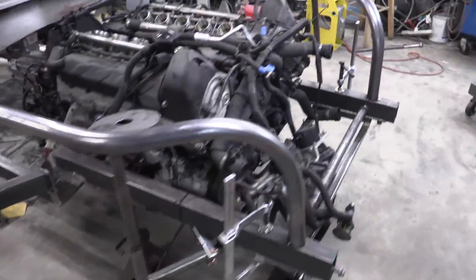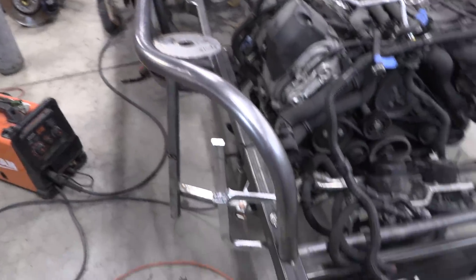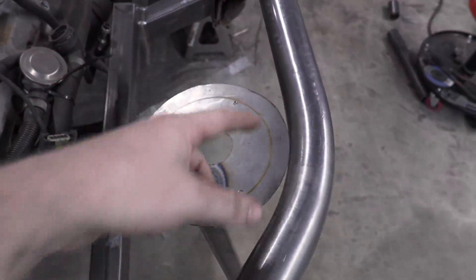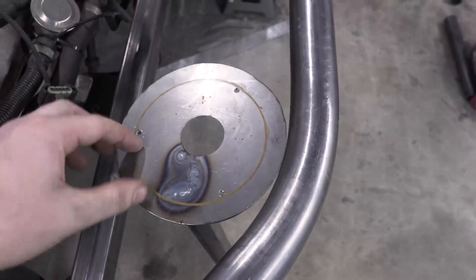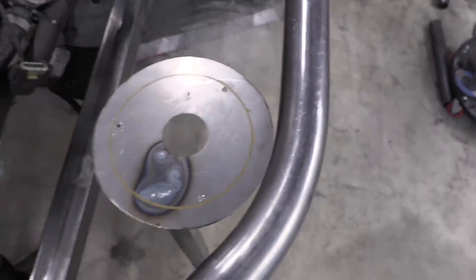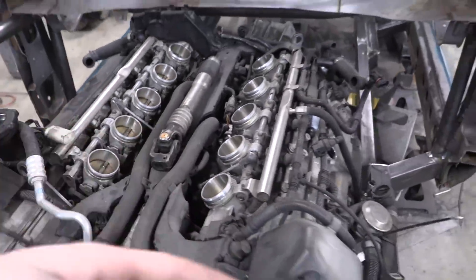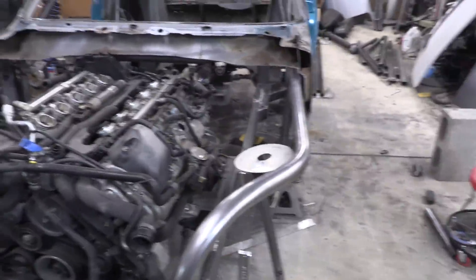We did it — we pulled it off. There was a point earlier today when we thought we weren't going to be able to make tight enough bends to pull this off at all. But I'm super happy to say we got this thing in here exactly how I wanted it, exactly how I envisioned it the whole time. One more bar comes back into that bar I just did across, then we build a cool-looking bent bar out here, fill this area with a plate that has a pattern cut out of the center, and that's where it goes. We're also going to machine out some sort of camber plate for the three strut bolts so you could move the strut inboard — though normally a camber plate works differently with the top hat. I did see all your comments about cleaning these things up. Honestly, they're so dirty they're going to need a thorough cleaning anyway, so I'll start keeping them more covered.